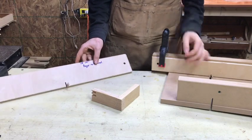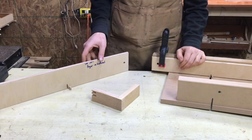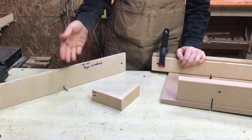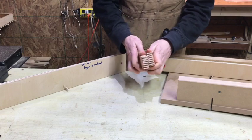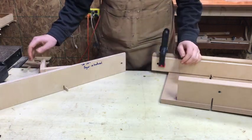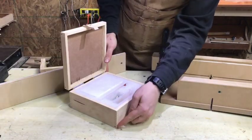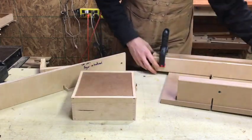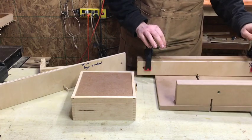In this video we're going to walk through how to make a very basic finger joint jig. The same process is essentially identical for a box joint jig on your table saw with a dado set, but this is specifically geared toward people who only have a single table saw blade and want to make finger joints with it. I use this to make a lot of shop storage, like a box to store my dial indicator. Essentially all this is is something removable that can be put on your crosscut sled.